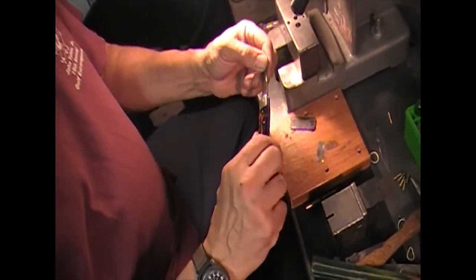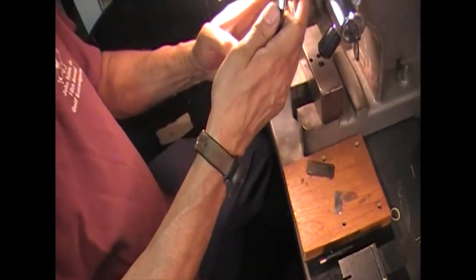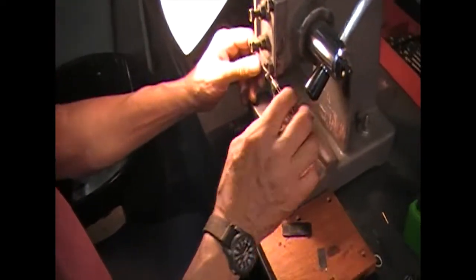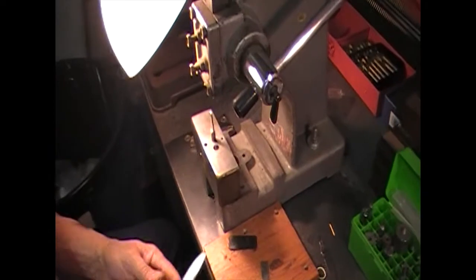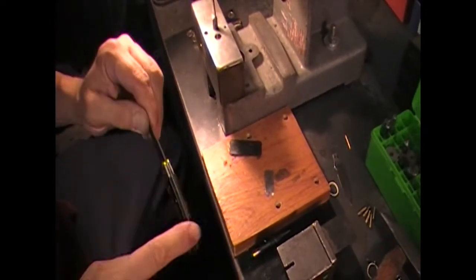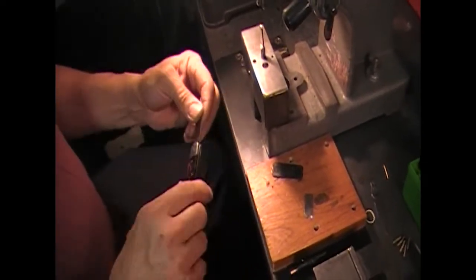The joints on this look pretty good. If this were higher it would mean that the end grind was a little bit off and wasn't dropping into the notch. We had an operation at the cutlery done right on an arbor press — you put a pin in here, another pin like that, put it on, and push the lock lever down into the notch, usually further than you needed to. Then you'd just tap it a couple of times, break it loose, and the guy would check it again to make sure the lock lever was where it was supposed to be.